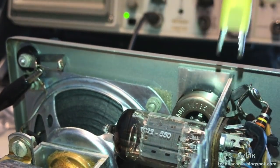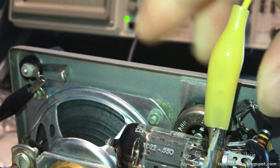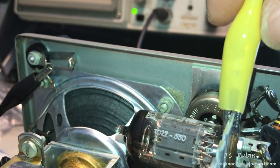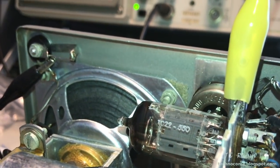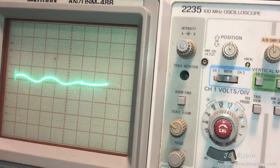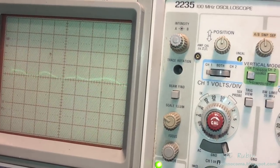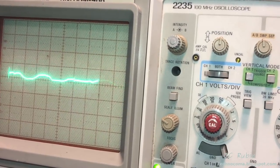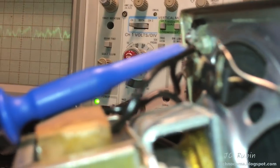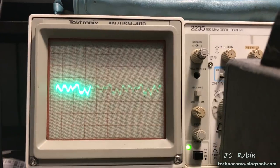On. Off. On. So whatever's coming from this 12AX7 down to here, if I ground out that signal, everything goes dead quiet. You'll note that even grounded, there is this distortion on the speaker. But you have to remember, we're measuring from the speaker here. This is an imperfect measuring point, so we have to allow for some of this. This is about as quiet as you could get something this small with a single diode for a rectifier in such a small package.